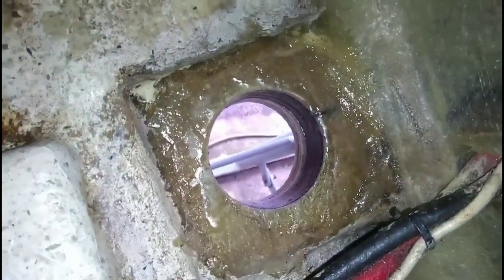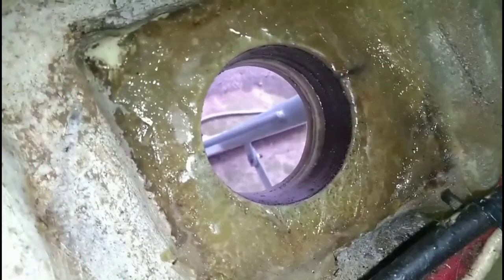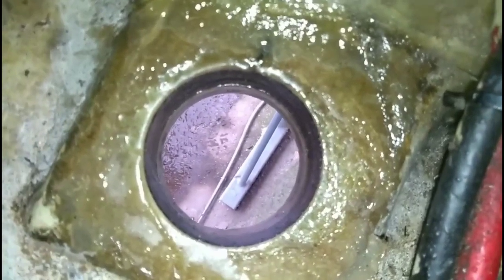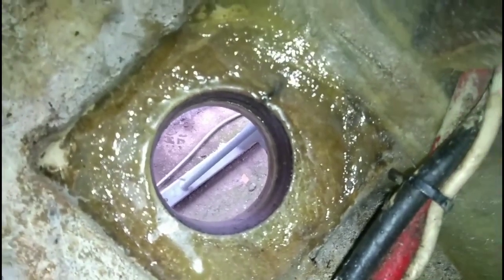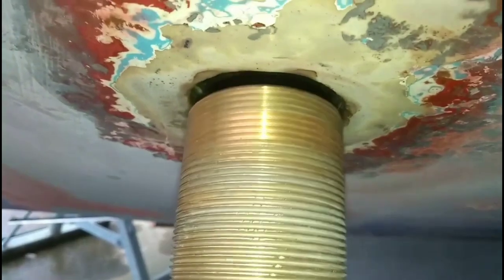Here is the inside. As you can see it had an existing backing plate, and all that lovely fresh wood in there has now been beautifully sealed with resin. And that is basically 2-inch BSP, which works out at about 60mm. It's a nice tight fit, but before we glue anything up or seal anything up, we're going to be doing a dry fit.